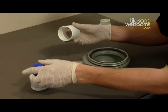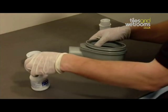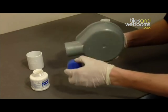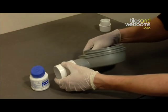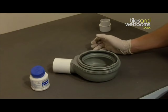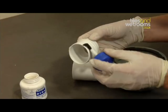You are now ready to install your waste pipe and trap, which is found in the installation kit. The waste trap and fittings are all solvent weld products. We recommend that you keep all pipes and drainage parts clean at all times, and that they are cleaned properly with the appropriate solvent waste pipe cleaner prior to connection of all the fittings. After cleaning, apply the solvent weld adhesive as shown. The pipe moulded to the trap is a 2-inch standard solvent pipe and has a built-in 3-degree fall.